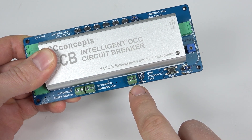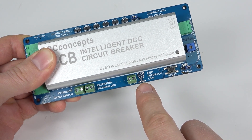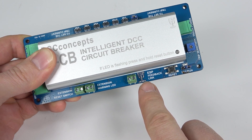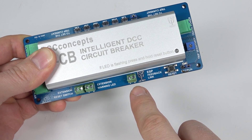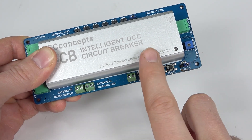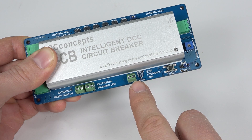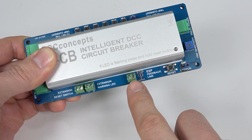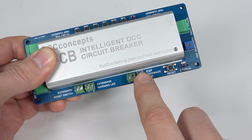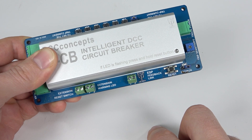It does have an ESP feedback link. This is the wireless system that DCC Concepts has pioneered. It goes to a high state — giving a higher output than the low state — when there isn't a short circuit on the line. You can wirelessly notify something on your control panel, for example a little LED, just to say there's a short circuit on the track.